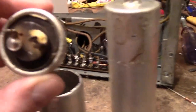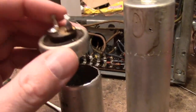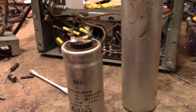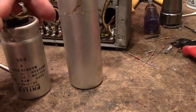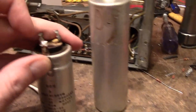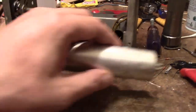Similarly, this one has two lugs — I just drill holes through the bakelite, feed my positive leads for the dual section caps up through here, and for the negative I'll go through the side and solder on to it. The cardboard insulating cover holds it all together when remounted. I've got my three tie points.